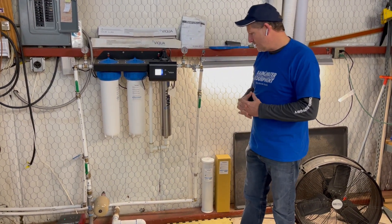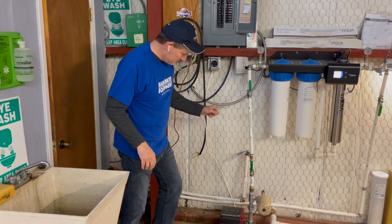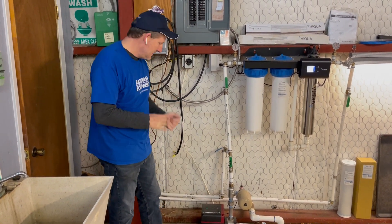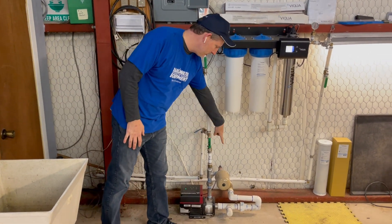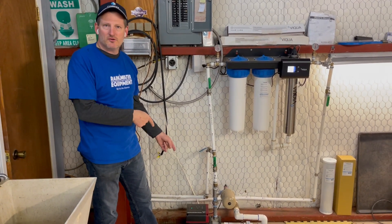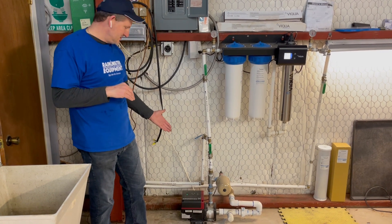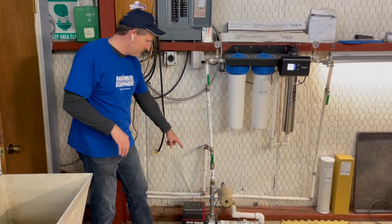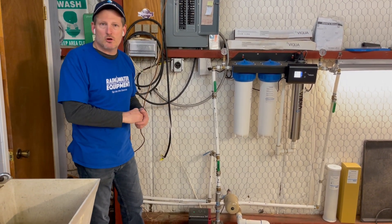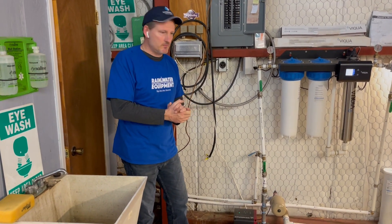This pump is a CME Plus made by Grundfos. They also have a model called the CMBE, which is their above-ground constant pressure line. These pumps have a pressure transducer or sensor on the back side that monitors the pressure in the piping system, and that's what tells the drive on top of the pump to speed up or slow down. If someone were to turn water on somewhere, the pressure sensor would recognize a drop in pressure in the piping, turn the pump on, and you'd hear it speed up and slow down — just like the one we looked at earlier.